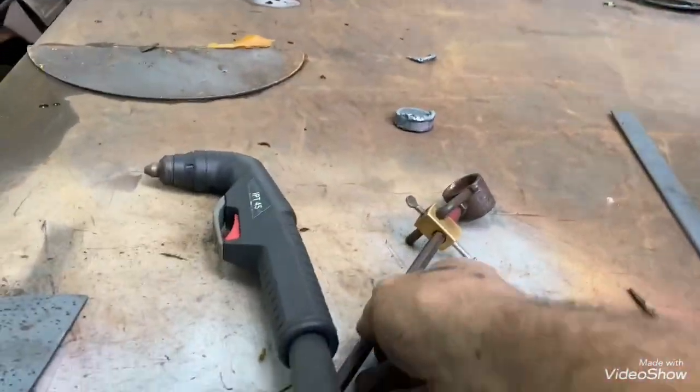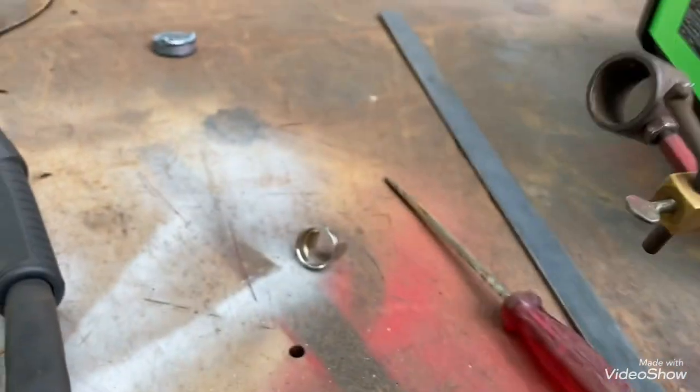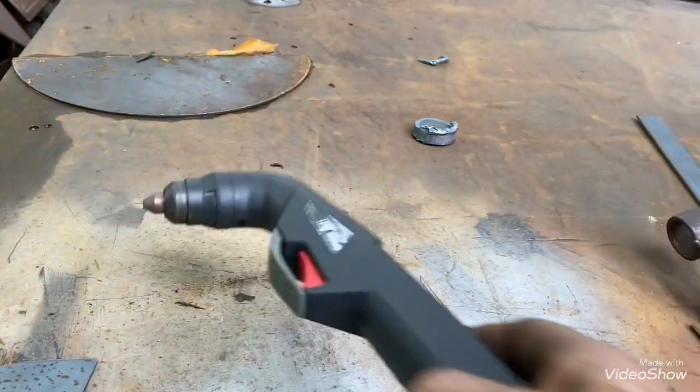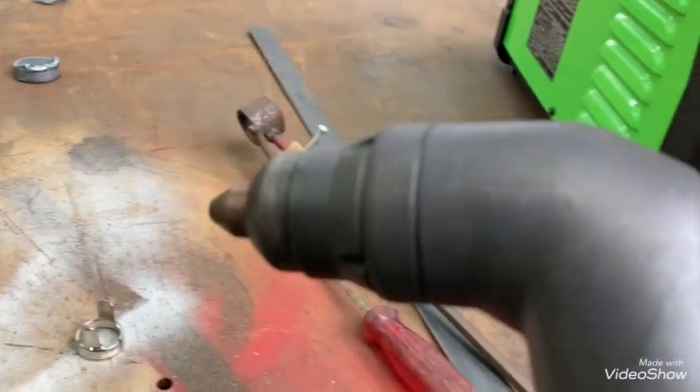In my opinion, I don't see anything wrong with this titanium machine. It seems to be a good machine. The HTP is better, though, that's just my opinion. It's a bigger machine, and it's blowing through harder. The only thing I noticed is with the circle burner on there, I had to modify it some. I made it to go on that HTP one. It actually started as a circle burner for a torch. But when it's on here, you can't leave that drag cap on there. It gets it way too high.